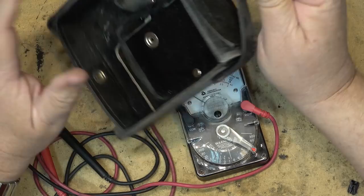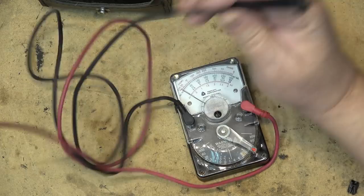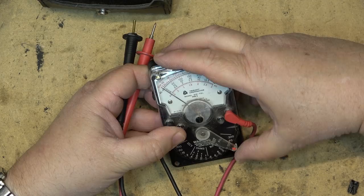I have a clip on here so I can carry it on my belt. Test leads were here, and we'd go up a pole, clip it onto the messenger, and use it for measuring lines. We would use it for checking capacitance and so forth on long loops, looking for faults — that's how we used to troubleshoot a loop, by watching how the meter responded.